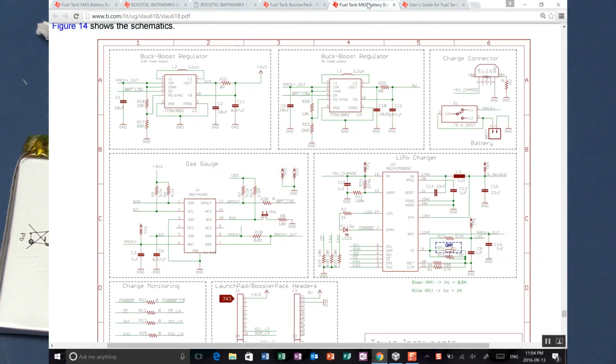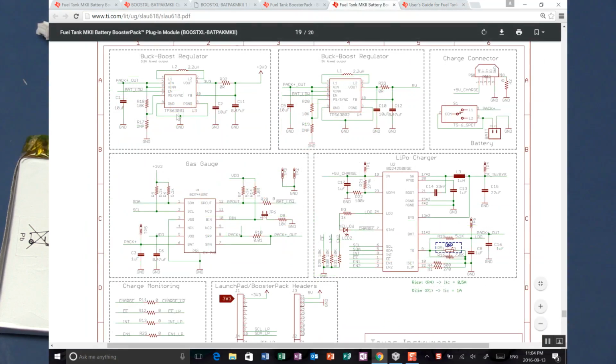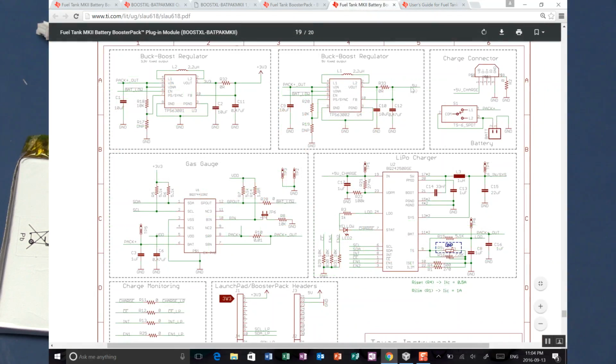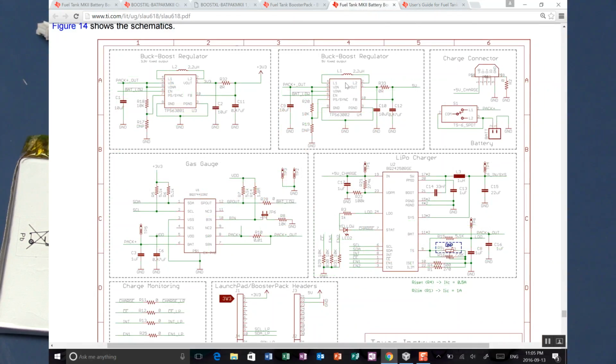Aside from that change, if you look here, you've got the TPS63001 and 002 again. The difference is that they've replaced the diodes pretty much with a 0 ohm resistor. So if you go back here, capacitor, diode, then output, this diode has been replaced with basically a short from a schematic perspective. So that's an improvement. Now you're actually getting the true voltages out because the set points for these regulators are built into them. The other change that we have is there's no jumper now between the outputs and the pins on the connector.